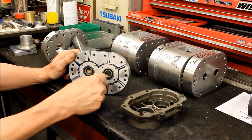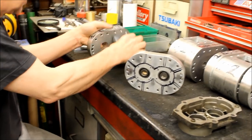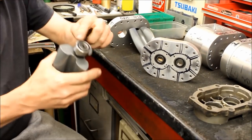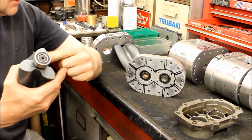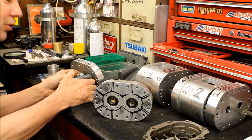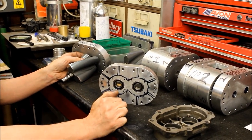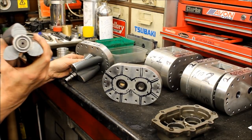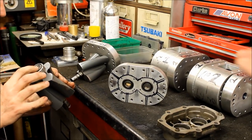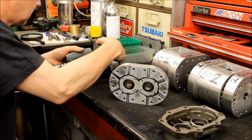What I'm going to have to do is make the plate and bore two clearance holes in it. The shafts on them - they're hardened. I could with the grinder cut through, but then grind them up - sounds awful. So with the amount sticking through, if you make a cap up we'll just have to make it a bit longer to disguise it. But if you do cut it off, what you end up losing is your centre - your datum point. So if you ever want to do anything on it, you've lost that. I'm going to make it look good - put some interesting machining in there, engrave it, put your initials on it.